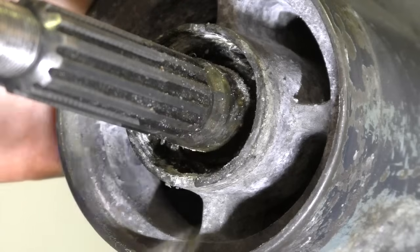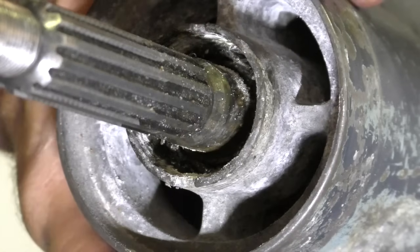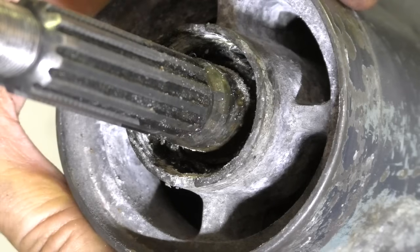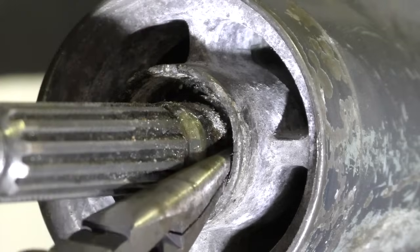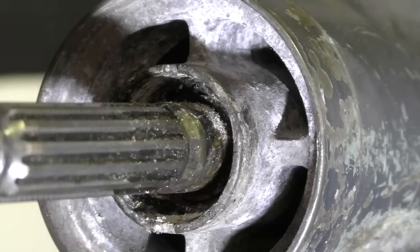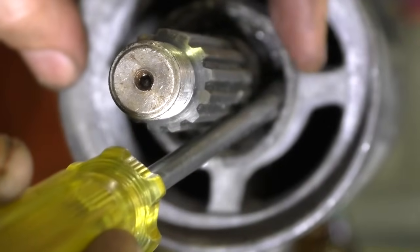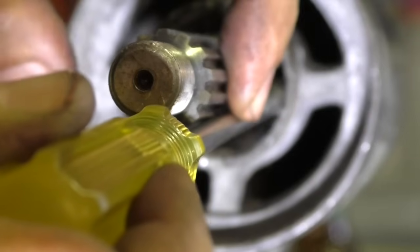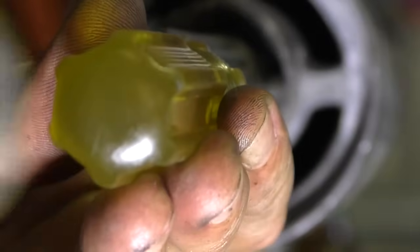That does two things. It obviously reduces the grip the oil seal has on this outer casing, but it also gives me a few sections where I can start trying to get some needle nose pliers in. The tip of the screwdriver's against the outer casing here, and the screwdriver itself's not touching the prop shaft or the splines here, so you're not risking damaging anything particularly sensitive.